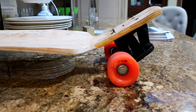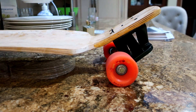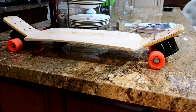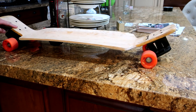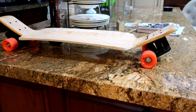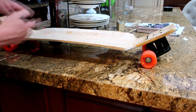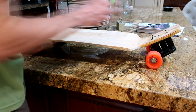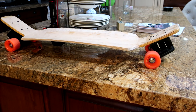Yes, there's a lot of truck in the way of anything. It does have some funky things going on with it, but the ride geometry should be pretty good. The pivot angles on the front and back are only about 30 degrees — I meant to get them to 35 degrees, which would have moved the axle a little bit closer to an acceptable distance between the bolt holes. But it ended up being about 29 or 28 degrees, so it's not going to be very turny. Aside from that, the geometry should be pretty rideable compared to the previous design, and I made sure to add a fillet on the model so it shouldn't break now.